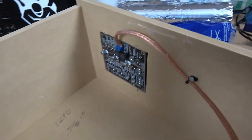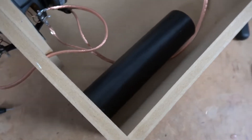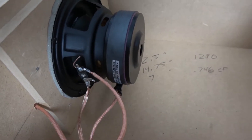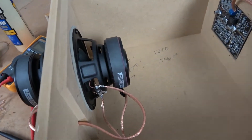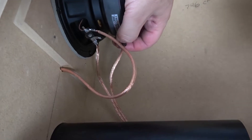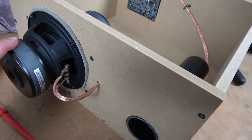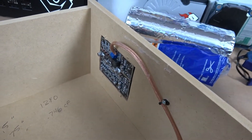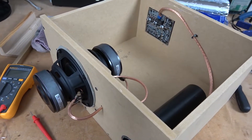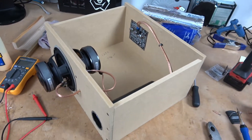We're all buttoned up. I have the plate amplifier wired up in its bridged mode. We have our port installed — I used some hot glue to hold it in place. It is a prototype after all, but that will seal it up so there are no air gaps. These subwoofers are 4 ohm, which means they need to be wired in series to work with our plate amplifier, so I need an 8 ohm load. So we have positive going to positive, negative going to the other speaker. Since this is an isobaric system, it has to go out of phase — negative to negative, positive comes back and goes directly to the plate amplifier. At that point the entire system is at an 8 ohm load, though I measured it at about 7.5 ohms with the meter.